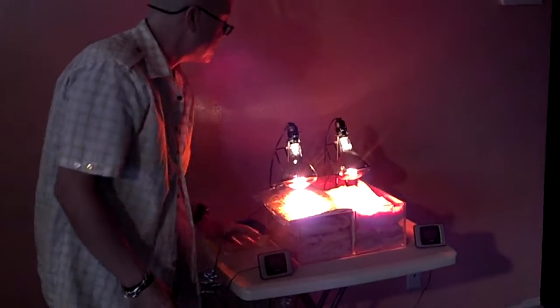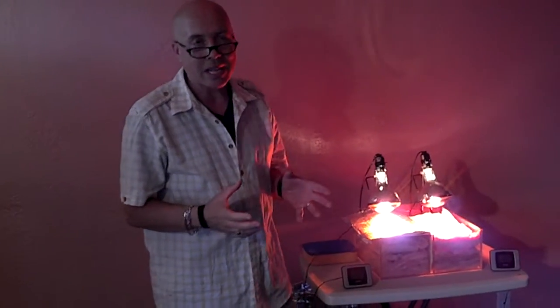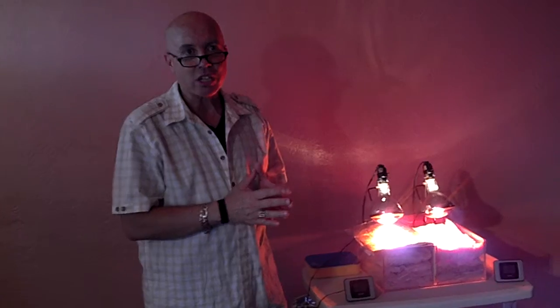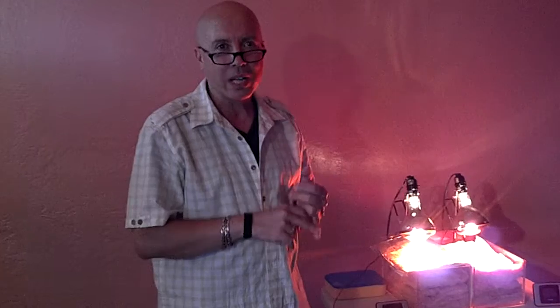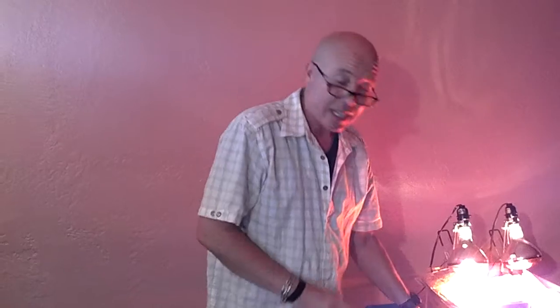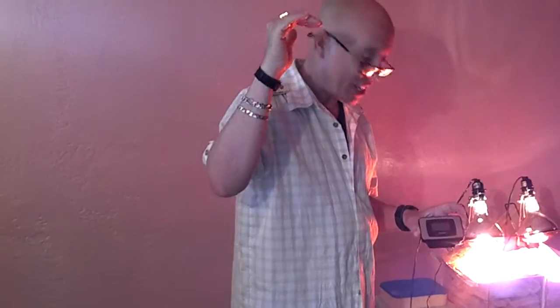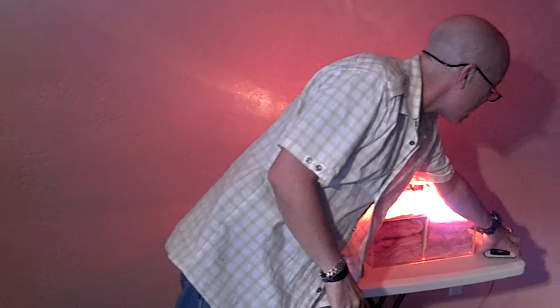Now what I tell people is to set your thermostat to 78 degrees, because every degree below 78 degrees that you have your thermostat set to in the summer for air conditioning costs you 6% more energy. 6% more on your electric bill, 6% more for every degree below 78 degrees. So I tell people, set it at 78 degrees. That's a comfortable temperature and it'll save you a ton of money. At 78 degrees, that air conditioner cuts on. We're at 74 degrees. The air conditioner has not cut on. We'll call this my house. My house, the air conditioner has not cut on yet.